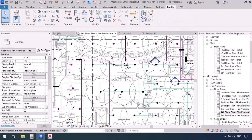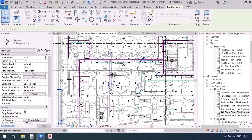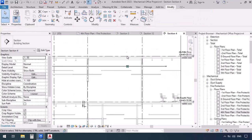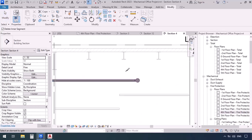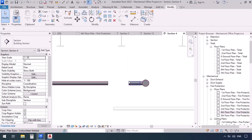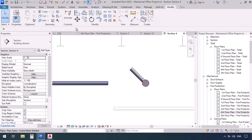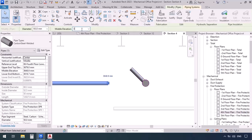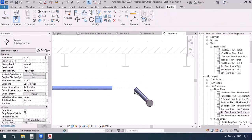We've just drawn and connected this branch. Let's go take a look in section and see what has happened to this part. I'm going to put this section here and expand it, then right-click and go to view. First, let's check the elevation — there is enough space for this pipe to go higher. So I can just use split with 1 and 2 clicks, then delete the unions. Then I'm going to turn this to a 45-degree angle or 135, and change this one's elevation to 3900. Let's double-check — there is nothing interrupting anything. Now trim TR to connect these two together.